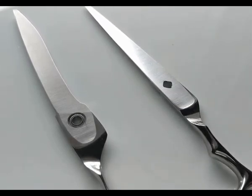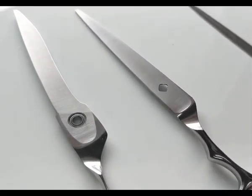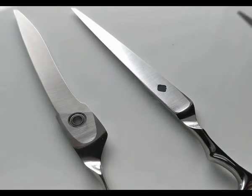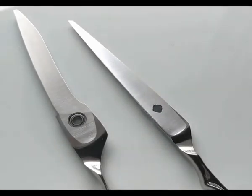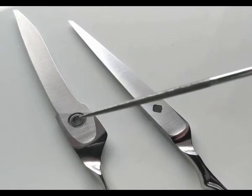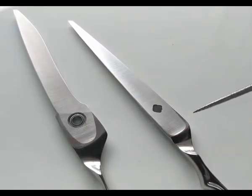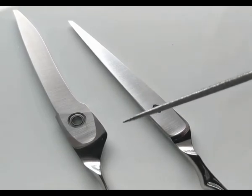And this is the main part of the scissor that wears over time. You'll see they look quite different. I'm going to show you this one a little bit this way as well so you can have a look at it and move it a bit. This scissor has a machined alignment face and machined alignment rails and a machined hollow grind, and this one is the hand one.